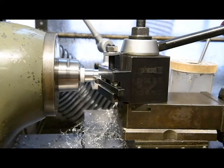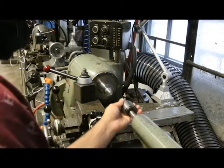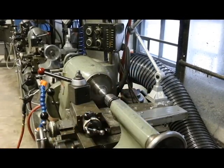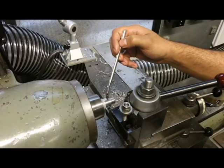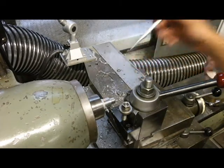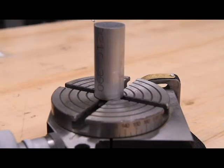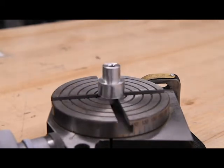Install a center drill into a drill chuck and insert the chuck into the tail stock. Set the speed as before. Lubricate the drill and make a small pilot hole. Replace the center drill with the one quarter inch drill bit and then drill the hole in the end of your material. Install the parting tool, change the speed, and lubricate the piece constantly while you cut into the material. Your piece should gently fall down into the bed of the lathe — be careful, the part will be hot. That's it for the lathe part and the machining lab. Sign up online for an in-person training session and we'll see you in the shop.